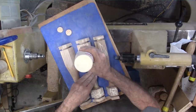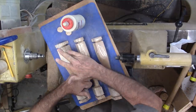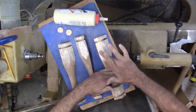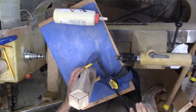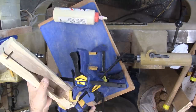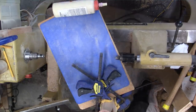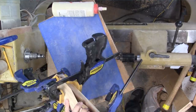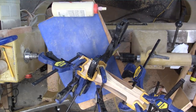Reverse the staves. Gluing the staves is an interesting process. I chose Titebond Original Extend Glue for a longer working time — I'll let it dry overnight anyway. I use glue sparingly and take an extra wipe to reduce glue near the cut edges; the extra wipe will hopefully reduce squeeze out on the already turned surfaces. Since the surfaces have been finished, cleaning wet glue is not a big deal. Remember those grooves? Use a quarter inch disc in the joint to help with alignment — these don't need to be glued in.